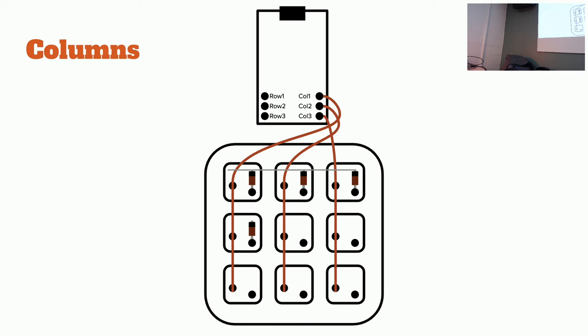Like I said, a lot of this is a lot of learning, figuring stuff out, like what techniques work best. It may seem like a simple electronics project, but there's a lot to learn. You'll really develop a good technique for soldering if you can get bare wire on wire connections. You could always try burning the insulation off of the wire before putting it down. You can also try chopping up the insulation with wire strippers or cutters. That might help cut through it, and as the solder flows and heats up, the insulation will pull back.